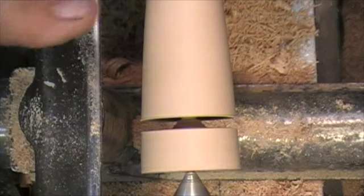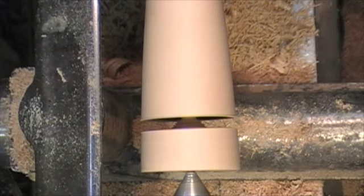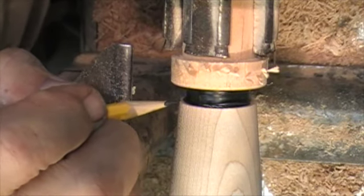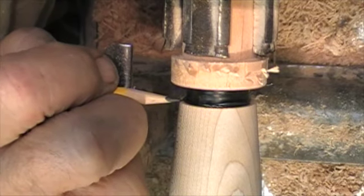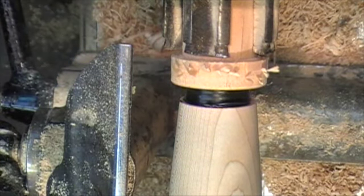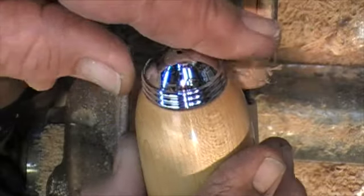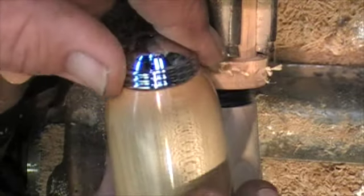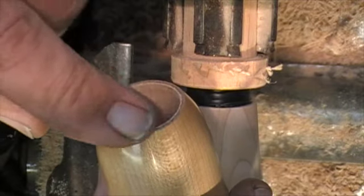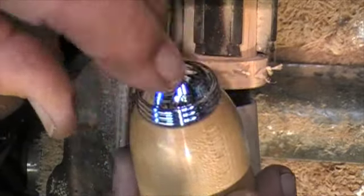Now, I want to say I'm happy with this design. One thing I do know is way up front, and I need to move you so you can see that. Do you see the shoulder right here? Yeah. That's about a 1/16 heavy, a light 1/8. That shoulder we need so that my dispenser has got a place to stop. If it was sharp, it would not look very good hiding underneath that edge, and it would be very fragile. So we leave a shoulder. See that shoulder? You can back it out and test it and see if it looks nice, because you can always go back up because you're referenced. You're between centers. But we want that little shoulder.